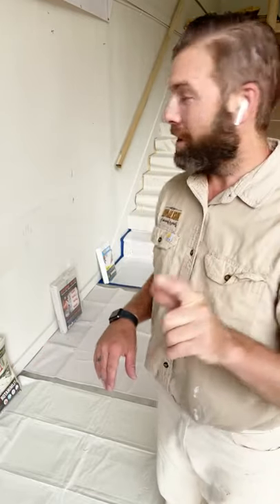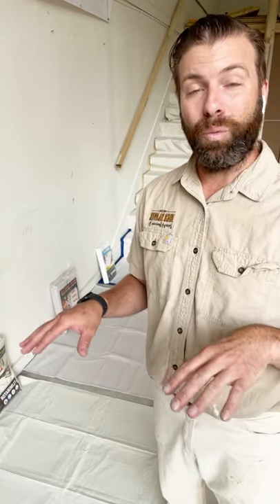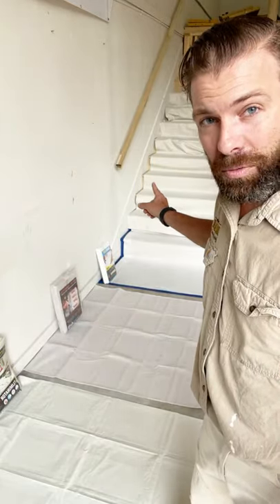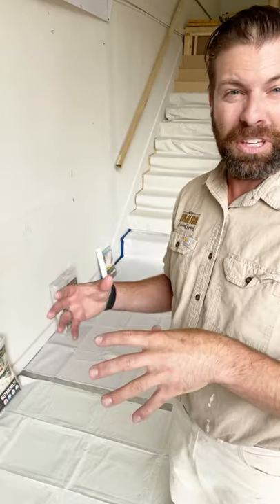Beach House Painting says they're like diapers for your floor — and that's no joke. In diapers there's actually a coagulant that when it touches water, it coagulates. This product uses no chemical, but the absorbent top works similarly. I tested the thin disposable SmartGrip by dumping a quart of water on top — 30 seconds later it was wet on top but absorbed in, and it didn't puddle. If you drop paint on a stairwell and try to ball up regular plastic, it can run and get on the carpet. This stuff spill-contained it, and you can ball it up and get it out without dripping.